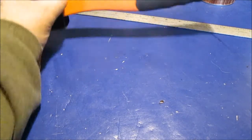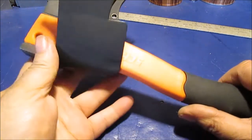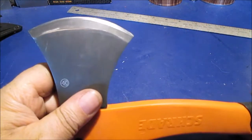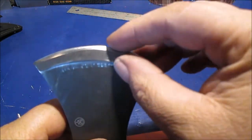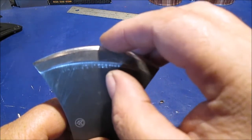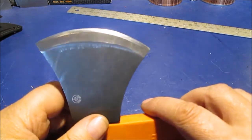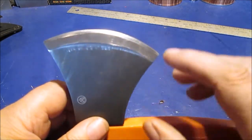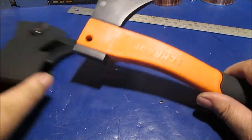I don't want this video to be too long. This is the newer hatchet — they call it something like 13CR steel, that stainless steel modern metal. You will not sharpen this with a file. I did try — what happens is if you think you're starting to get an edge, it just crumbles and falls off. You get a little fine edge and it crumbles away. You have to sharpen it with a belt sharpener. I did attempt to change the profile on this one — it's going to go probably inside my backpack.